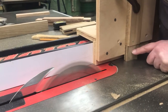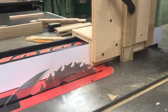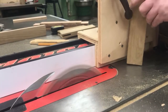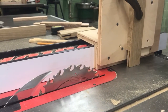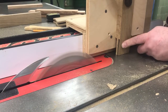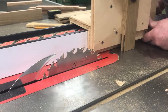Notice we left a little thin piece in there — just a little over, that's not a big deal. Just move my fence back, take another cut around so I can remove that material from the other side. I left it here. Now some people at this point might just go ahead and pull it out, but that could rip your board. It's easy enough — just move your fence back.